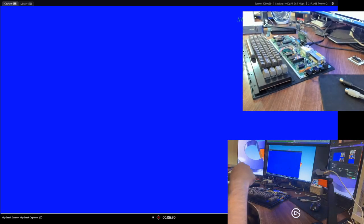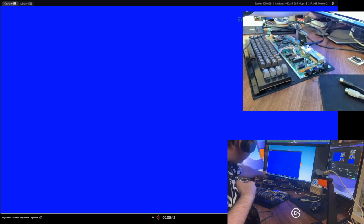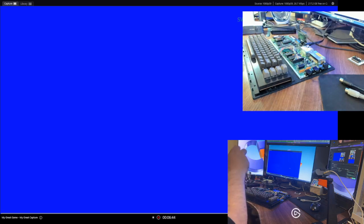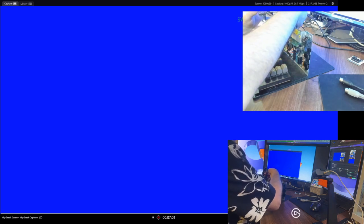And the reason I say that is because if I unplug this guy and I take a standard mini USB and I plug it into this power wart. Actually, let's plug it into this one here. I've got another one all the way over here. That's directly into the socket. He's going to provide 5 volts DC to the Raspberry Pi. Now, the discovery, from watching other people's videos, is that when you hook up a device that provides 5 volts, like even the HDMI through certain mods, you can actually provide 5 volts to the entire system.